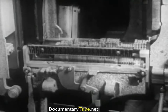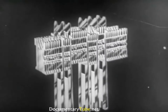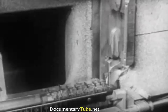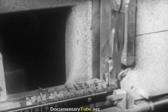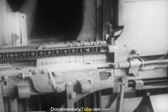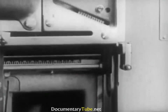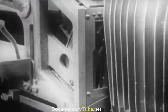For greater convenience, the upper part of the assembling elevator is equipped with a hinged gate. A steel wedge known as a space band is assembled between one word and the next. The space bands are released by the keys situated at the left of the keyboard. Because of their dimensions, the space bands cannot fit into the matrix magazine; therefore, they are stored in a box above the assembling elevator. The parts for releasing the space bands are similar to those which release the matrices from the magazine.